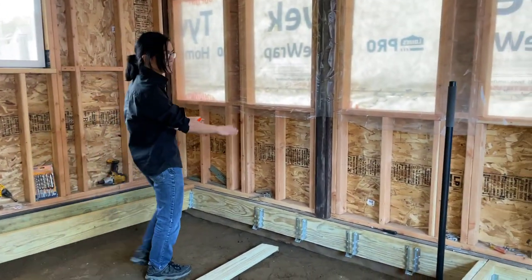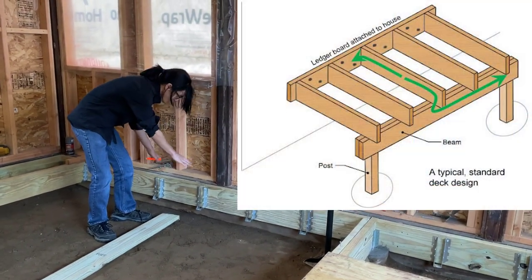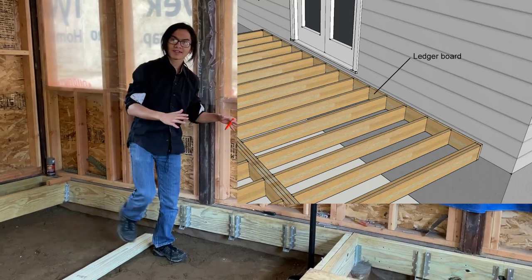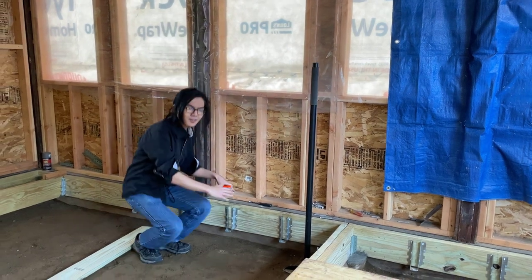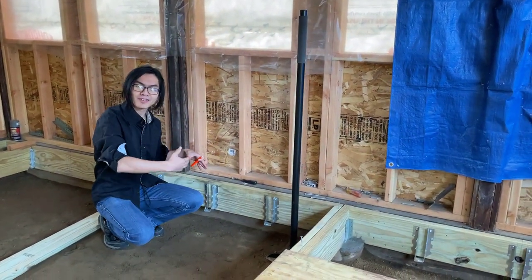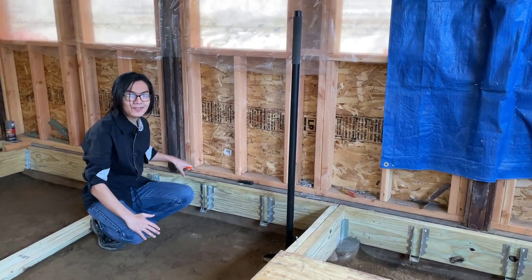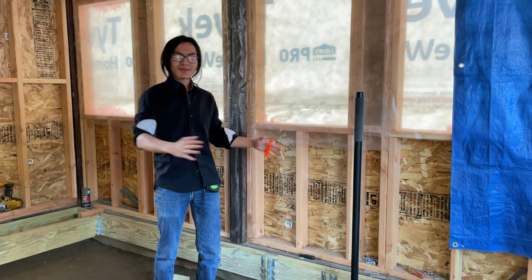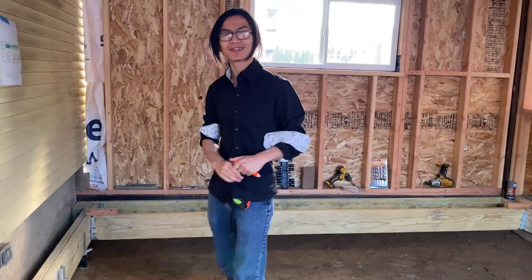These pieces of wood on this side of the patio are beams, but they're not beams in the same way as those flush beams. These are called headers or ledgers. When you're building a deck, usually you're supposed to attach it to the side of a house, and that's what these header or ledger beams would be for — you wouldn't have to double them up because you're attaching them to the house. In our case, we're attaching them to these railroad ties, which essentially serves the same purpose. I just wanted to make the distinction between headers and ledgers and flush beams, which is a very cool distinction.